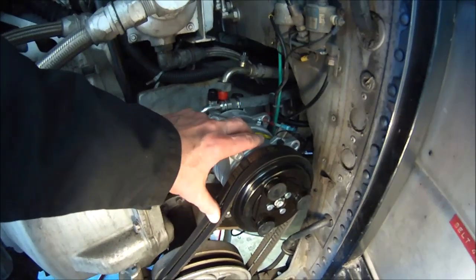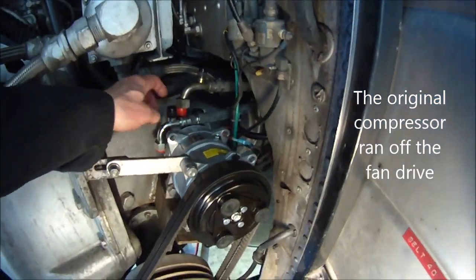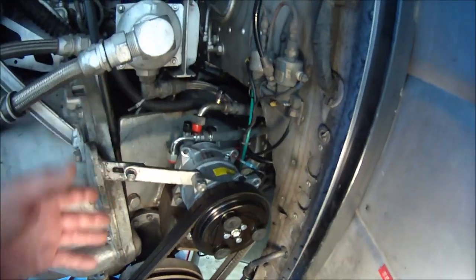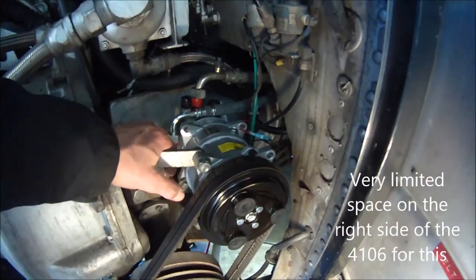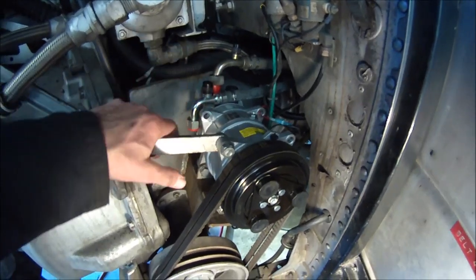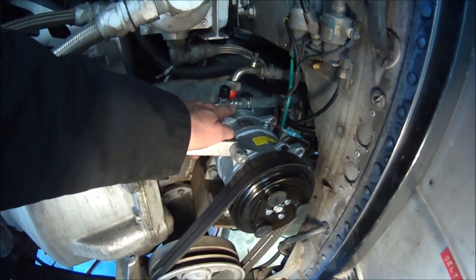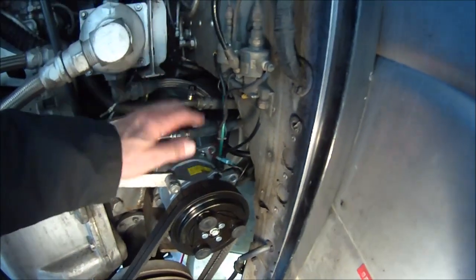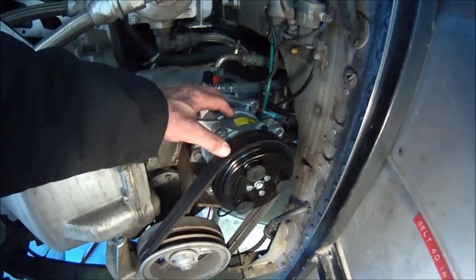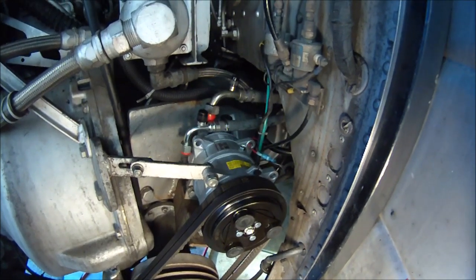Then it got old and quit. We put another one on, and I screwed up the installation — I let too much oil escape because I forgot to put the Schrader valve in the high or low pressure side. When I put it in, all the oil came out and I tried to balance the oil, but I should have started over and I didn't. Anyway, the lines aren't hooked up yet — that's the next step. I think what happened before was something froze off and the high pressure line completely blew off the end of the compressor, which I think roached it. So I put in a high pressure cutoff switch right next to the compressor on the high pressure line.